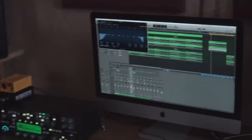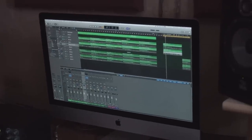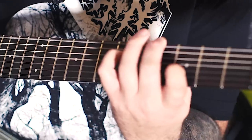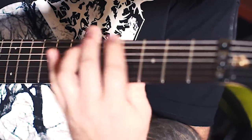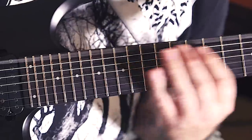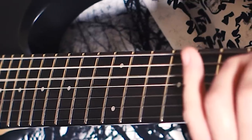I've gotten to check these out in my home recording studio and played them in a bunch of different guitars live. The one thing I've always liked about rail-style pickups as opposed to pole pieces is what it tends to do to the high end, particularly between 5k and 8k. It does a pleasant sort of smoothing thing where things can get pretty hairy and nasty on pole-piece style pickups. And then the management of low-end frequencies is probably where I think it shines most.